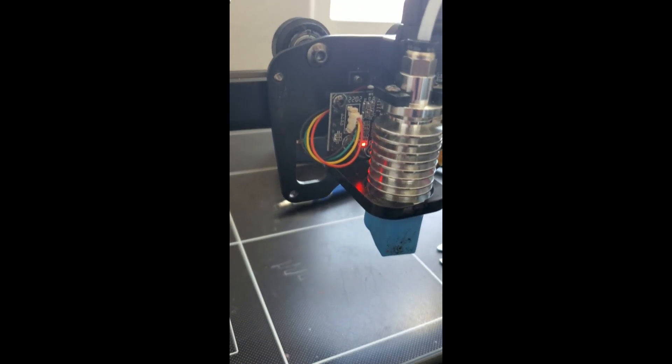I'm going to try and level it and see what happens. This ribbon cable is very faulty. I'll bet that one of the pins in this ribbon cable is delivering power and that pin is probably defective. It becomes a problem because power being transferred from the power supply over into this hot end controls the heat, the fans, the leveling system — everything. So if the fans go out, you're going to have a heat creep problem, which is what I experienced. I MacGyvered something together and it seemed to work very well until I realized that my fans were not working, and I got a clog in the PTFE tube.